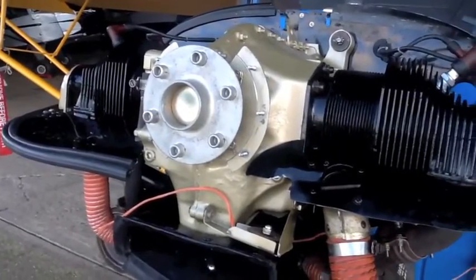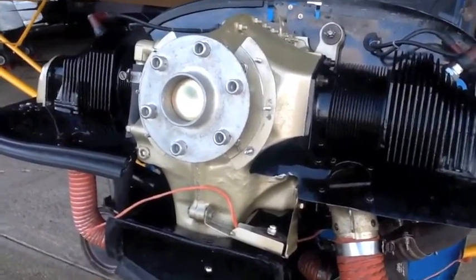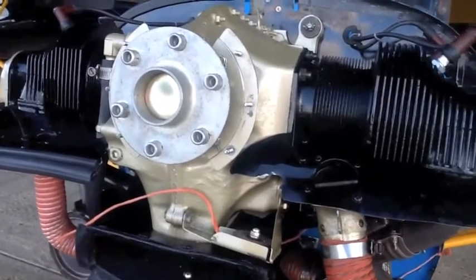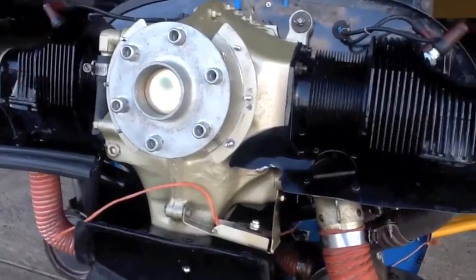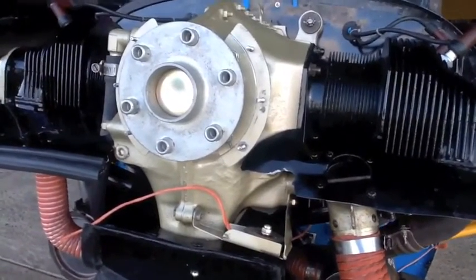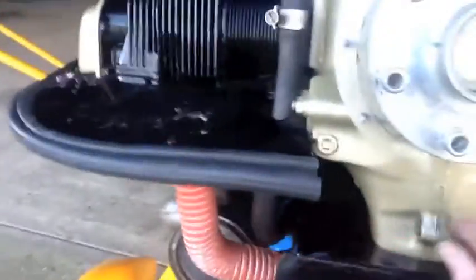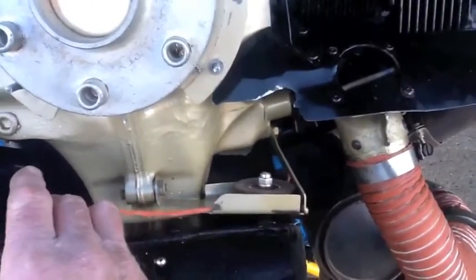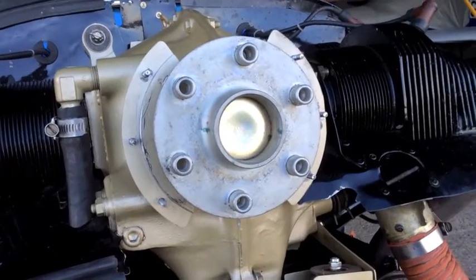The starter is of course fitted after the nose bowl has been attached. However, because it is very difficult indeed to feed the starter cable through the various pulleys after the nose bowl is in place, it is very important to leave a pull-through in place. Here I have a piece of good old fashioned English baler twine which has been left through the pulleys, waiting to be used as a pull-through for the starter cable.